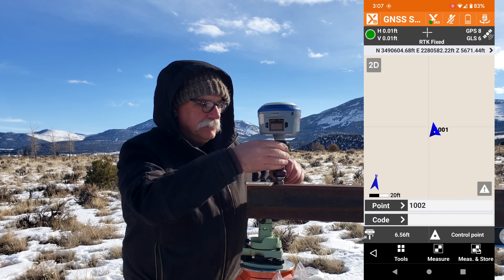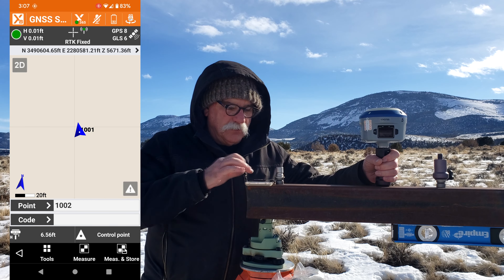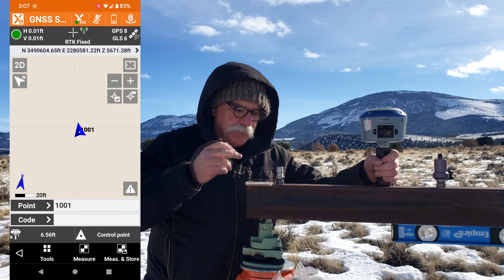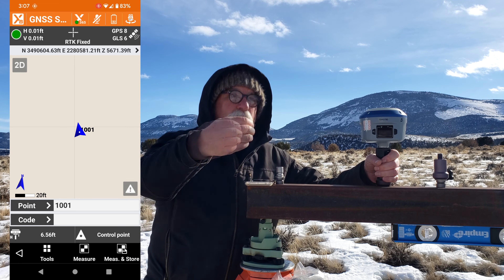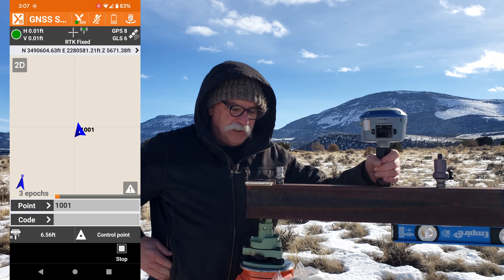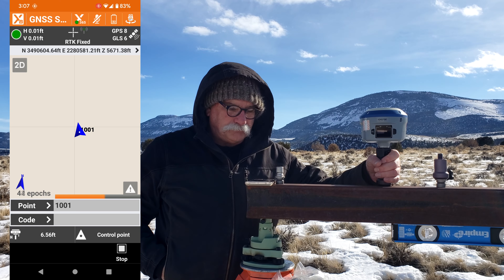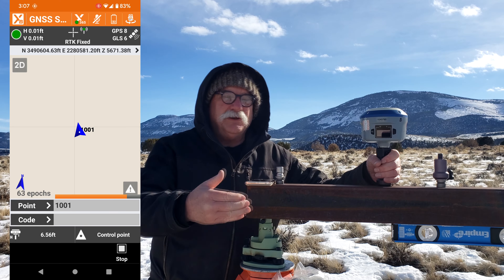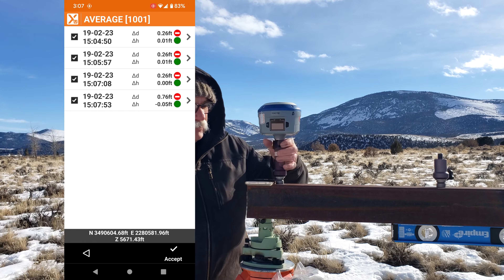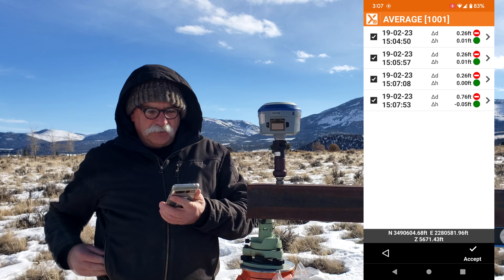The quick connect I have on here is frozen. So I'm going to take another measure. I'm not going to bother dumping it because I've obviously got a bad fix that I'm simulating by moving the receiver more than my tolerance. Click on measure and store, measure again, additional measure. This is simulating a bad fix where the receiver thinks it's got a blue-sky fix. And you'll see that that position is busted horizontally — vertically it's not bad. I'm going to keep that fourth shot, I'll accept it.